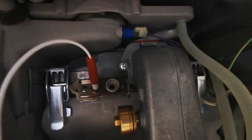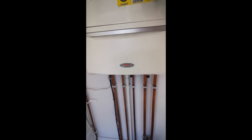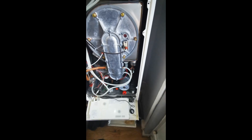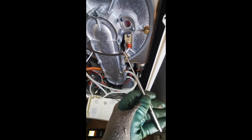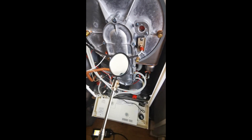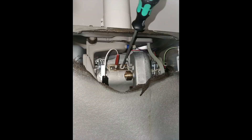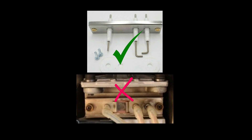All you need is a little mirror — telescopic if possible — and you just get it around the seals, around the burner and the sight glass. If there's any steaming at all, you need to change the seal, change the sight glass, or change the actual electrode itself. Not many manufacturers do the sight glass on its own unless it's sort of commercial. Do your visuals on it — if there's any cracks in that sight glass, just don't take any chances and get it replaced.